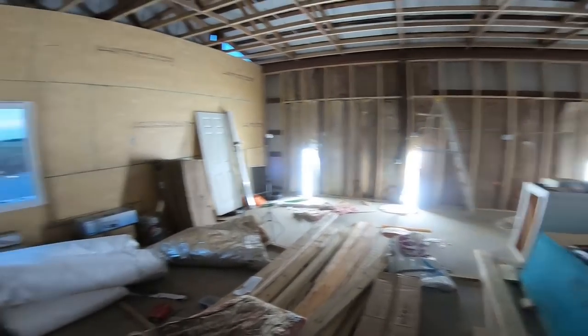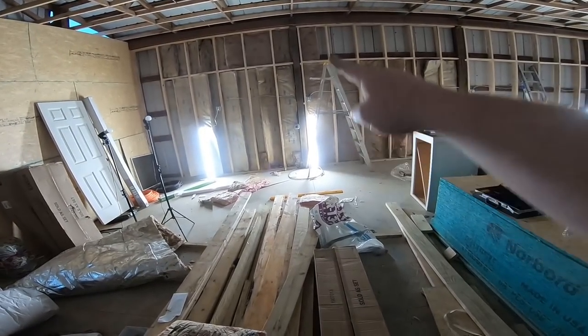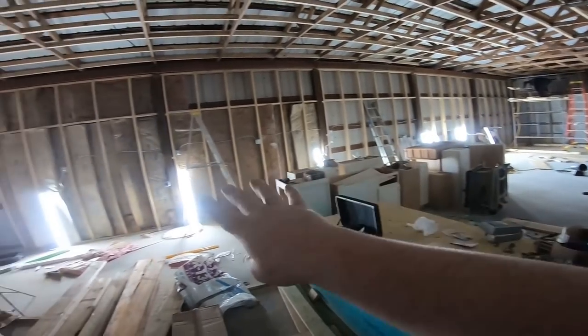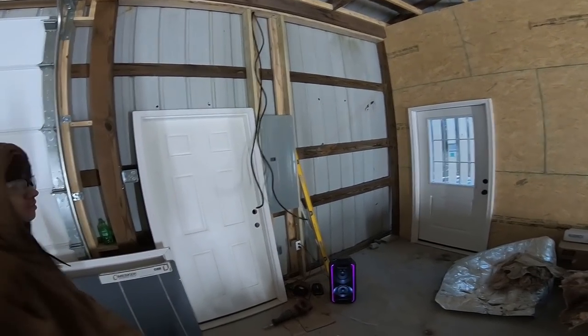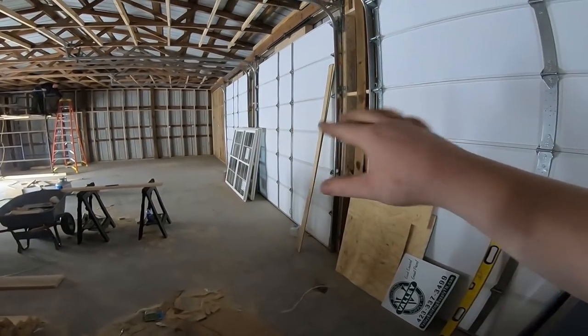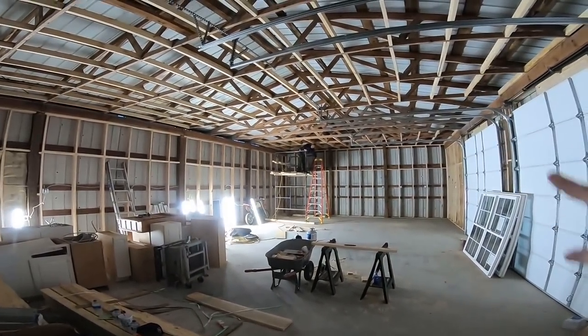And we got the wall up. Wall's up, baby. So we got a 220 plug at this 6x6, at that one, as well as that one. And they're all 50 amp, 6 gauge wire. We have two of them ran. Two wires are there. The plugs are all installed and hooked up. I just need to run them in the breaker box. We have an outlet to do there and in between each garage door that'll be on their own breaker, as well as we got to put outlets up for garage door motors for future.